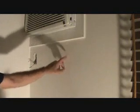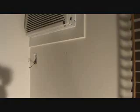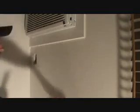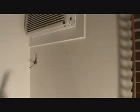Okay, well, right where that is, I'm glad I did that, because outside, down low, there's a GFI plug outside. So I know there might be some wires down inside this bay. In between this 2x4 and this 2x4, this is called a bay. Okay? In between there. So when I cut that, I don't want to just start jabbing that and cutting that out with a sawzall or anything like that.